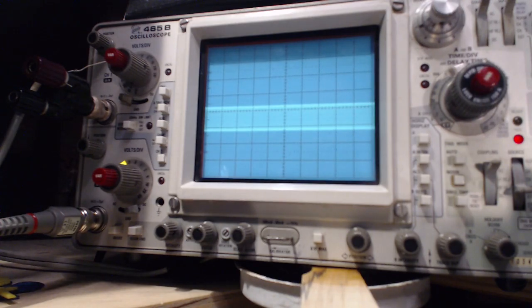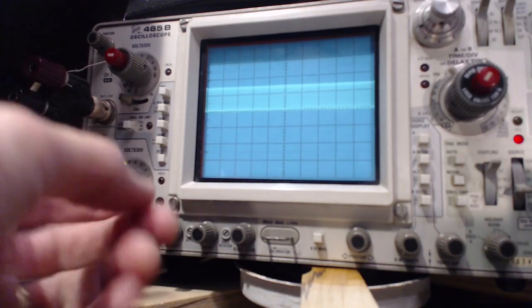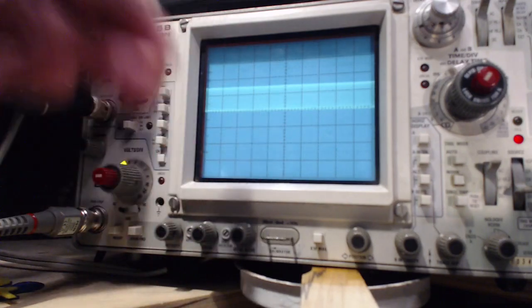Voltmeter. Oh, the voltmeter's not drawing it down very much. It's not moving on the scope now. What happened there? Okay, so the voltage I'm reading on my meter now, AC volts with a setting of 2 volts on the device, it's just under, no, 1.5, wrong scale, Jim. 0.55 volts. Now does that compare to this? 0.1 per division, 0.15.